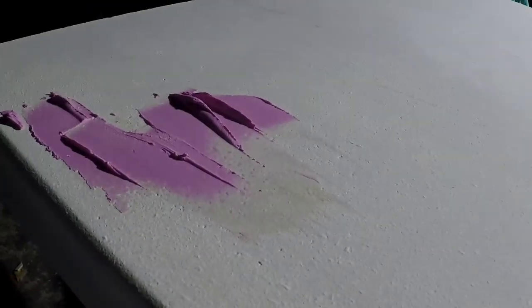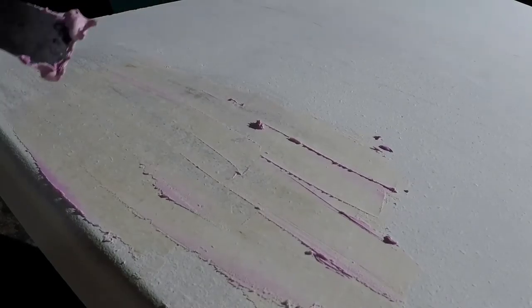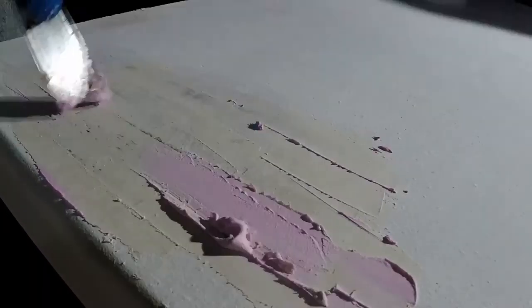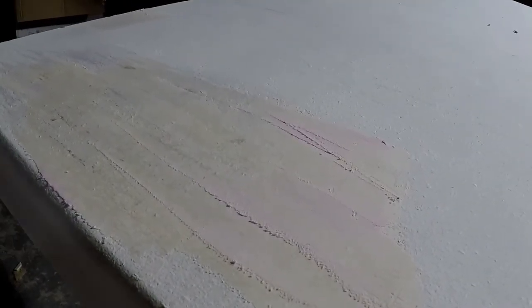After priming, some imperfections were noted. These imperfections were then repaired. Spackle has been used to fill in any holes. If you're wondering, why is the primed surface being spackled or repaired? Well, the imperfections did not stand out until the surface was primed, and it is not practical to sand the primer off.